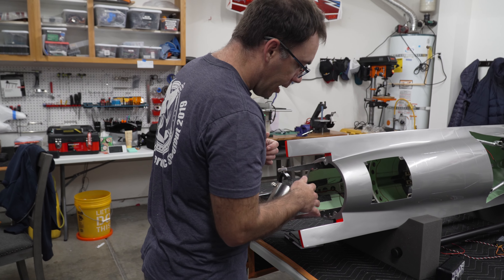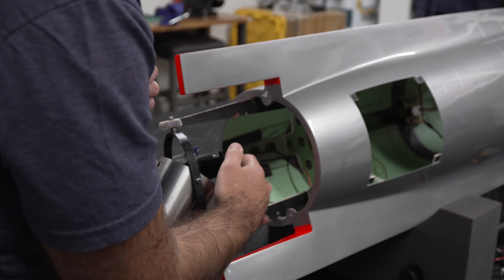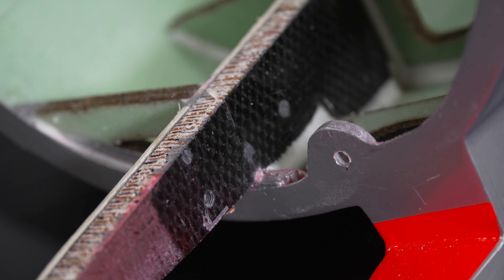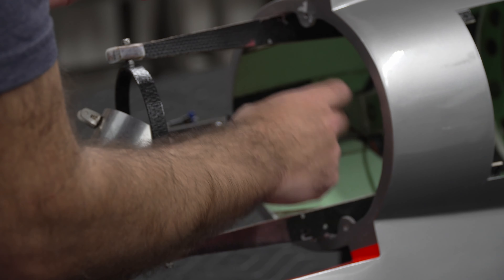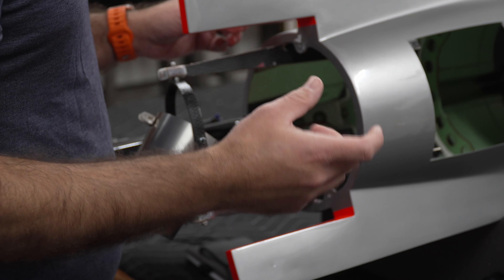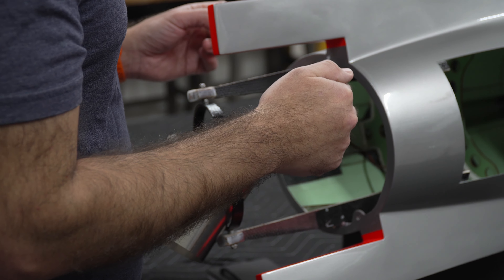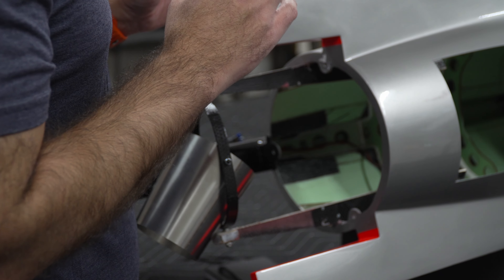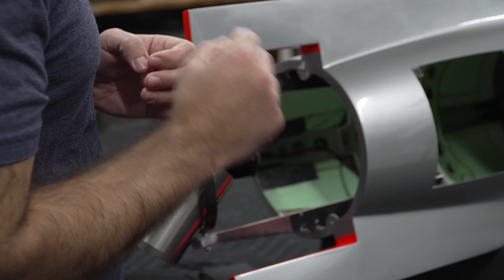For the turbine, we're using four mounting holes — two on each side. The two rear holes are very easy; the two front holes are very hard. The challenge is minimal clearance on top makes it nearly impossible to drill normally. Using a 90-degree adapter for the drill, I did a small initial hole, then with a file and some handmade tools we completed the hole to the right diameter.